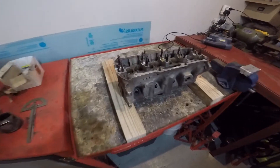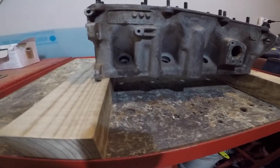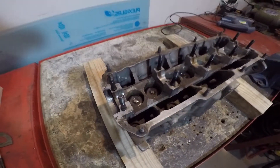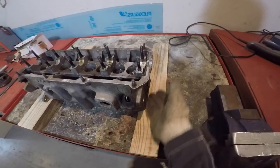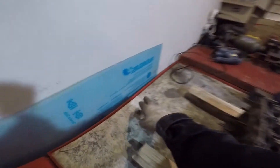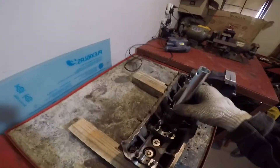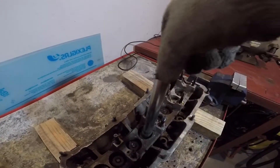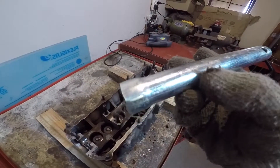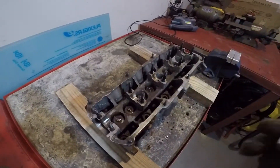The wood is done pretty much. The idea is that underneath I can get something in there to stop the valve pushing down when I press the spring down, and it also protects the face of the cylinder head. So that's step one complete. Now we're going to start on the fabrication of the lever system, which is going to basically fix somewhere here, then come up, pick up on this, and this will be our press. We'll have to modify this so we can get to the cotters.